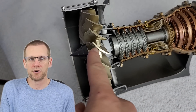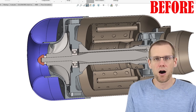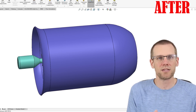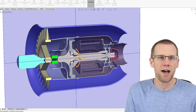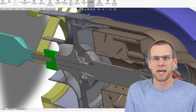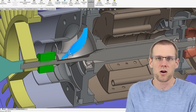The one major component we could change inside a radio controlled jet engine would essentially be adding the fan that exists at the front of a modern airliner engine, turning our turbojet engine into a turbofan engine. I've quickly drawn up a mock-up of what this would look like. Right at the front of the engine, we remove the nose cone, the starter, and all those components, and we extend that shaft by first using a transmission — specifically a planetary gear style transmission. The reason we want that is to minimize the diameter and length consumed within the engine, because we still need air flowing around these parts to get into our compressor wheel.